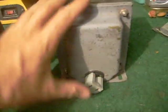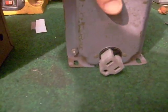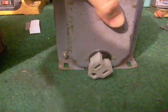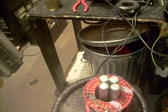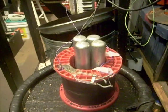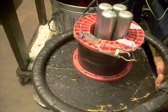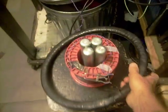You're probably wondering, if you're not familiar with an isolation transformer, what's the value of having a transformer that doesn't change the voltage in any way? Why would you want a transformer that simply puts the same voltage out on one side as what goes in on the other? Well, the main reason is you want to make sure that when you're working on a set you're electronically isolated from any potential of getting shocked. Let me explain it in simpler language.